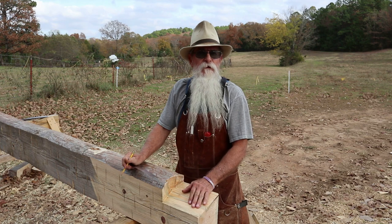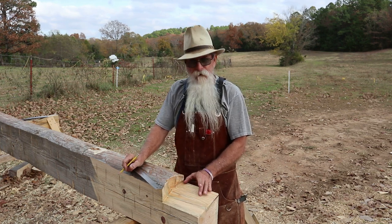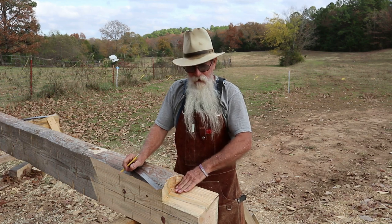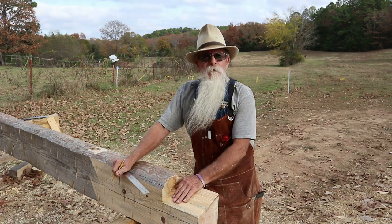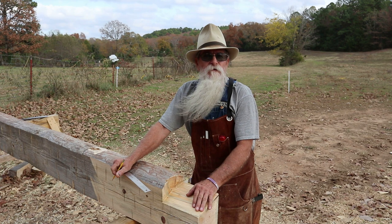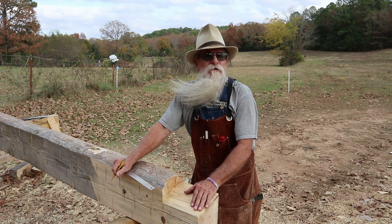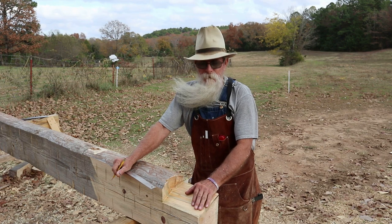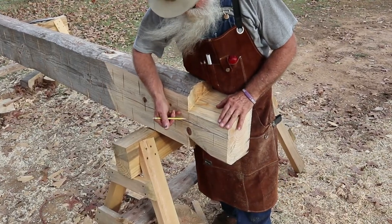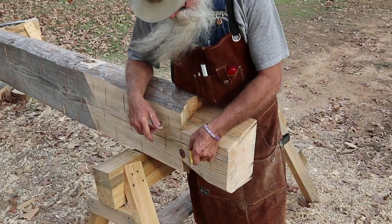It's kind of like a keyway. And then when I cut the plates, I will cut a part that goes down in this. This keyway will lock the bottom side of the plate log, and then the half log that goes over the B and D walls, I'll tie them into the plates and lock the top side of it so it can't slide out. So what I've done, I've come out from the shoulder here 2 inches and made a line